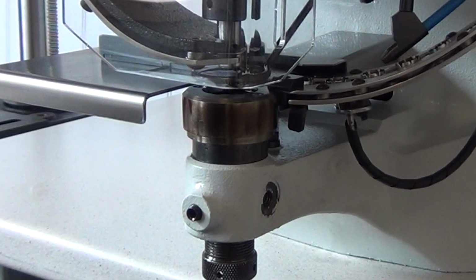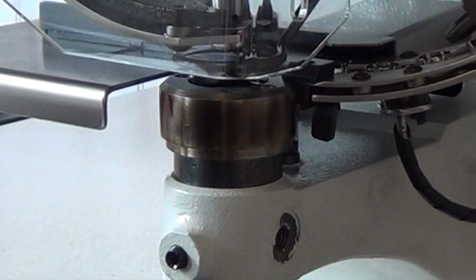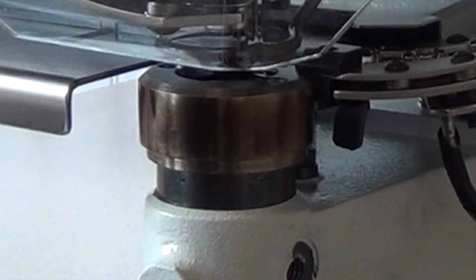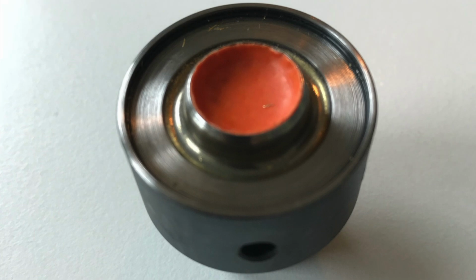The bottom die is located in the center of a part called the ring compensator set, which is immediately below the bottom of the safety guard in the photo shown here. To see the bottom die, this is one removed from the machine. The center blade of this die is used to automatically cut a hole in the material being utilized. You can see the orange material which has been cut by this blade.